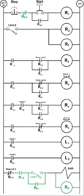First of all, we'll go back to this. This rung remembers the event has happened. If you were to ask that rung, hey, rung, is the event still happening? It would be like, I don't know. All I can tell you is that I have a memory of it occurring. And the event was that the cylinder extended for the first time.